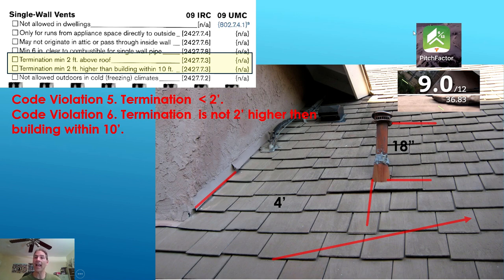In addition, take your Pitch Factor app and get a picture of the slope of this roof. In this case, it is 9/12. You cannot comfortably walk on a roof with a slope greater than 6/12. The roofing material is a fiber-cementitious tile that becomes brittle with age — this roof is at least 20 years old. If you were to walk on it, there is a high likelihood you could crack one of these tiles. Due to the material and the slope, for inspection purposes, you're not going to want to walk on this roof.